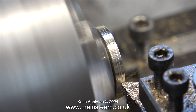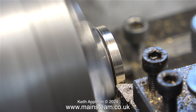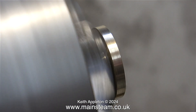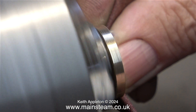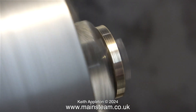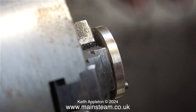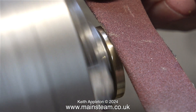At some time in the engine's past, someone has been hitting this part with a hammer in an attempt to straighten it. Once I'd machined away the hammer marks, all I needed to do was remove the sharp edges. Very, very carefully — because don't forget there is a crank pin spinning round very close to my hand — I'm removing the sharp edges. Don't forget 90-degree perfect edges are very sharp, even with or without a burr present.